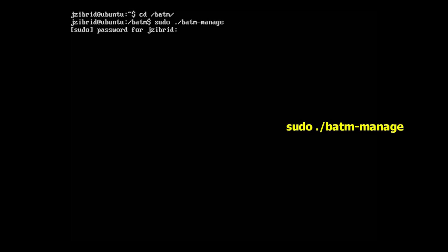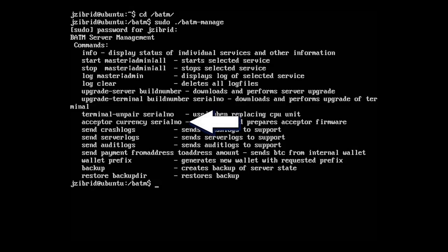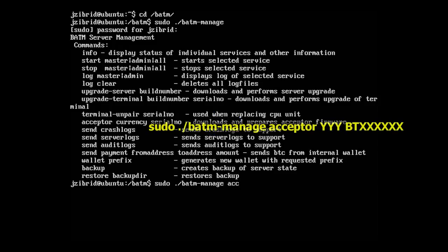So you have to log into the BATM server through console, and you have to prepare this firmware for the ATM on the server first. So we go to the console, we go to the directory BATM, we execute the batm-manage command, and here we see acceptor, currency, serial number. So we will execute batm-manage acceptor, then the currency will be, for instance, euro, EUR, it has to be uppercase, and then we specify the serial number of the machine which we want to upgrade,